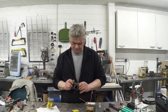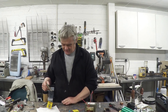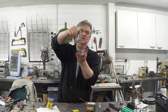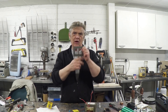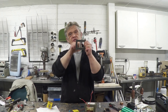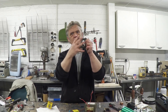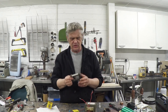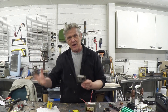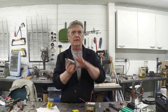So if I pop them together — there we go — got it. A little bit of steel here and absolutely nothing. These are very powerful magnets and there's quite a lot of them, but what happens is the magnetic flux is contained within this iron ring, so the north flows here to the south there. We've got magnetic flux containment — it's a magnetic circuit — and it means there's no flux escaping outside, so it can't pick anything up. We've got no magnetic field there; it's all inside.